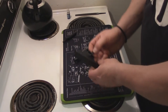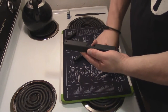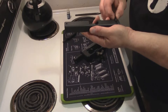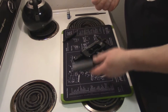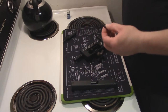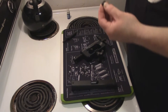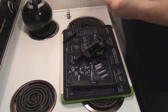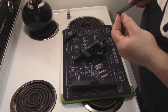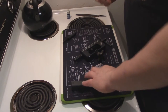So what we're going to do is make sure that the sight fits — the Glock dovetail is cut on a small radius — you want to make sure the sight will go at least halfway in. If you have to take any material off, you never take material off the dovetail on the firearm; you always take a flat file and file down the back side of the sight. We're just going to make a couple of strokes with this double-cut smooth file and basically just take that finish right off.